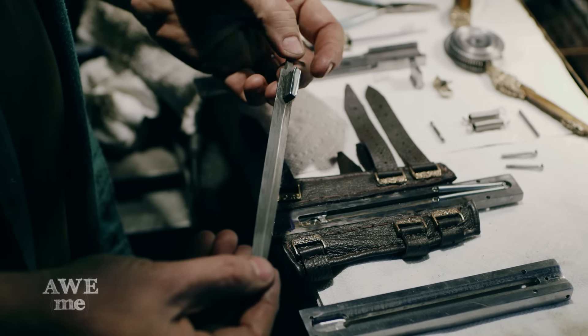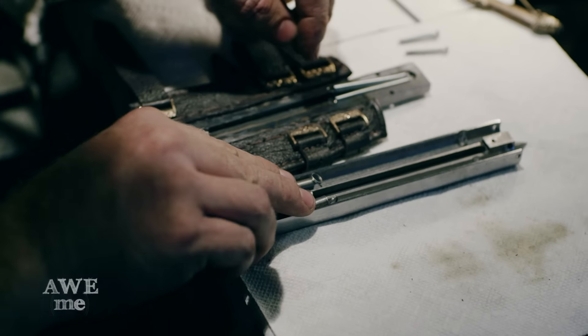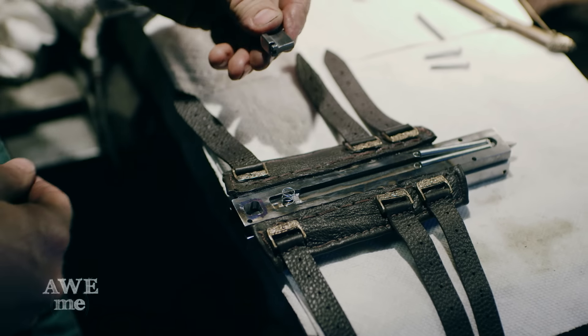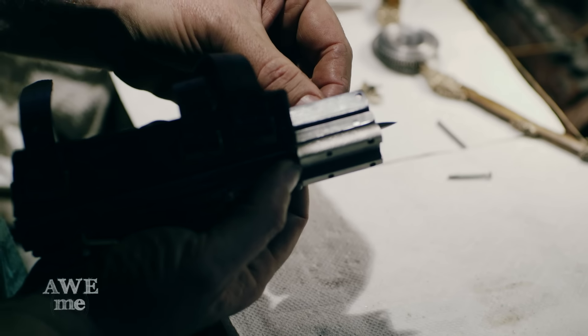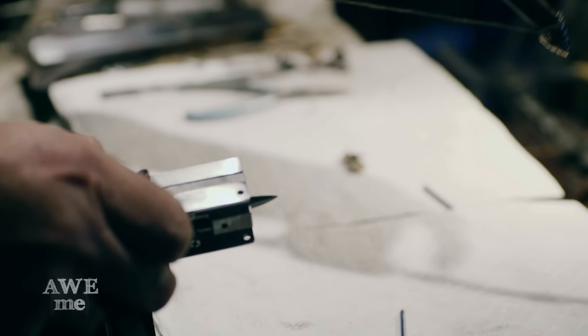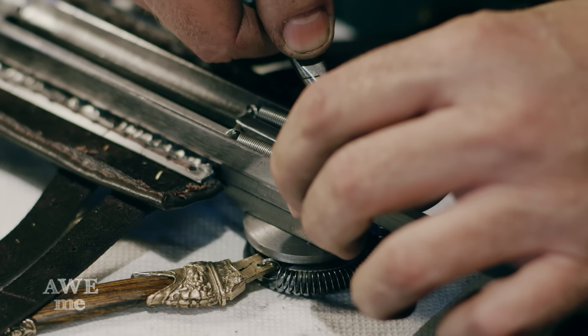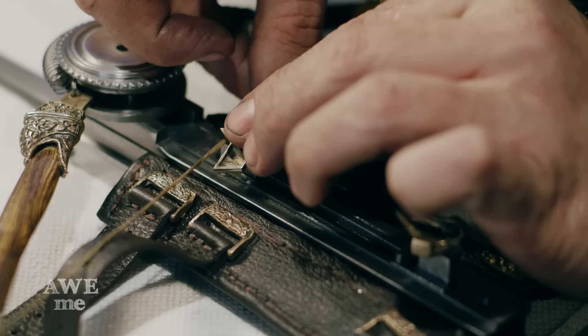Got our cable Damascus blade — the release, the spring latch and lock is going to be fitted in here. We're going to set the beginning of the springs. The second level of the piece has the spring for the release for the bow. The slider that holds the bolt goes on the top level, coming down gently on the spring area. I've got a pair of screws that come all the way through the entire piece. The bow assembly is already together. We set this rivet to hold the front of the springs — it'll become a floating rivet. There's a notch in the bottom of the bronze to hold the string. The release mechanism catches in these slots so we can set the bolt, and there's a large spring that'll shoot the blade out and lock it in place.